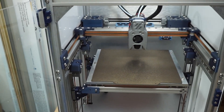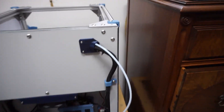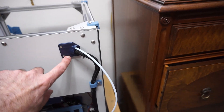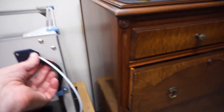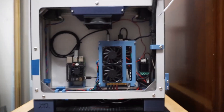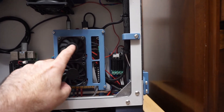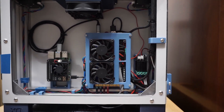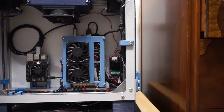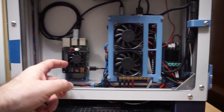Here's the back of the machine. You can see the umbilical and PTFE tube come out through a fitting I made — two fittings, one inside and one outside, friction fit. I'm running a standard BTT Octopus behind this shroud I made for the fans. In Klipper you can set the fan speed, so I have them running at about 50% — they're still doing great and much quieter than 100%.